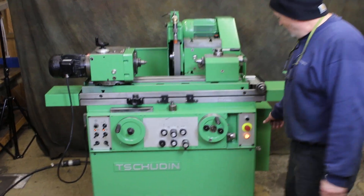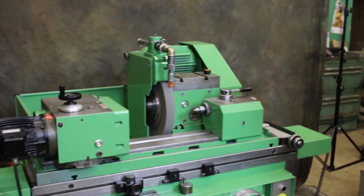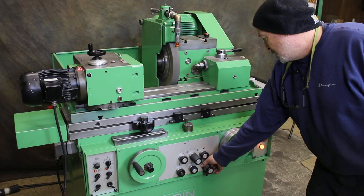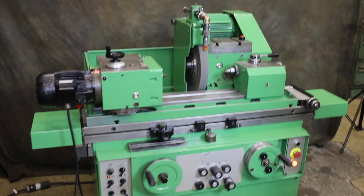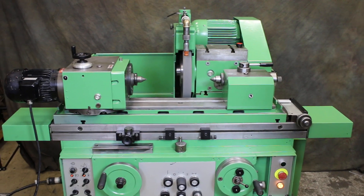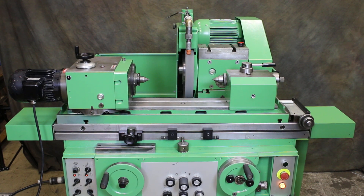I'm going to show you a fully automatic plunge grind cycle. We press the button and open up our feed right here, and we start to feed. There's a pin on the side here for your zero stop, and when it gets to zero, there'll be a time delay and the machine will retract on its own.